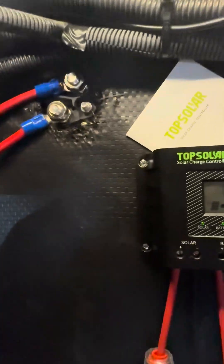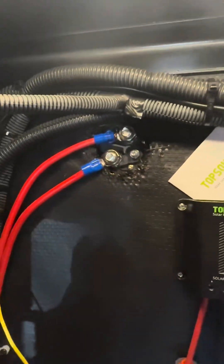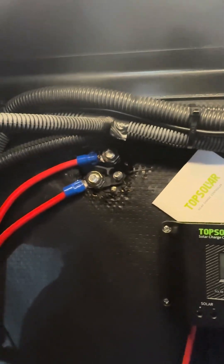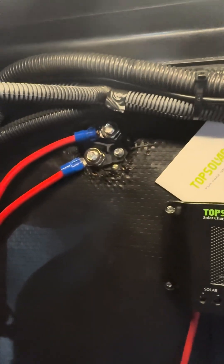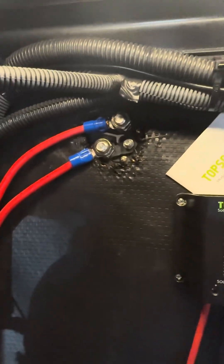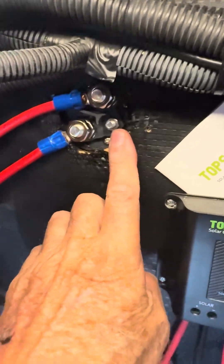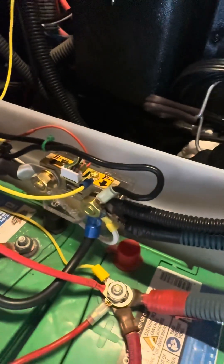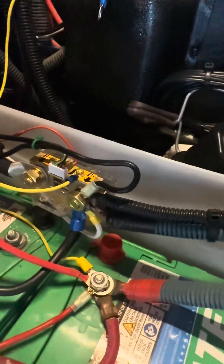This particular switch that I bought has a built-in voltmeter. I don't really need it but it's kind of handy because it's a visual clue that the battery disconnect is in the on position — this meter displays voltage when the disconnect is on and does not display voltage when the disconnect is off. In order to make that meter work you need to connect your ground wire to this lug. I have connected mine to my shunt, but you can connect to any place that's a solid negative ground anywhere in your system.